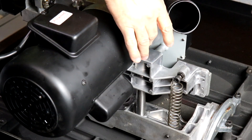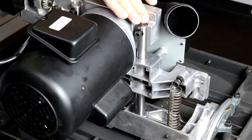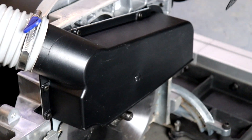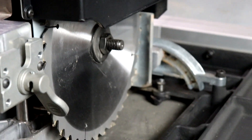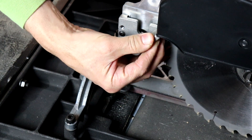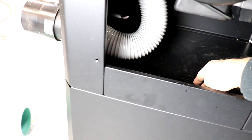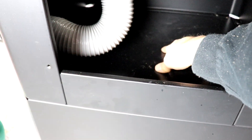These polished steel rods are important too, as they support the trunnion assembly as it raises and lowers in a straight vertical motion. You can also see the thoughtful design of the dust collection system, where the dust hose extends up to a shroud that wraps around the blade completely — this is absolutely the right way to collect dust rather than trying to draw from the entire body of a cabinet. Inside the cabinet there is a sealed bottom panel to improve dust collection, which means your dust collector's energy will be focused in a smaller area, giving you more effective collection.